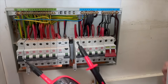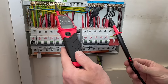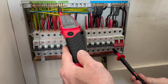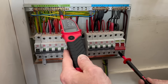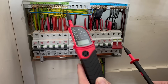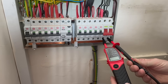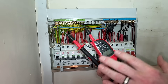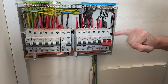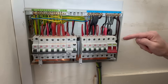I'm going to prove the bottom section in exactly the same way — it's now isolated. Same process: onto the earthing conductor at the bottom of the switch. We are now isolated off the line connection, and onto the neutral — still disconnected. Onto the protective conductor, then neutral first and line connection: we have a fully isolated board. Note that the top of the switch is still live, and in the next part of the video I'll show you a tip so you don't accidentally come in contact with those connections.